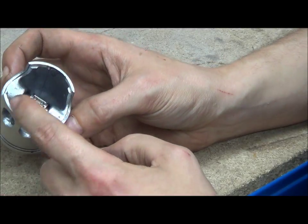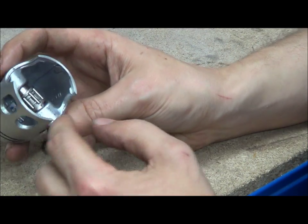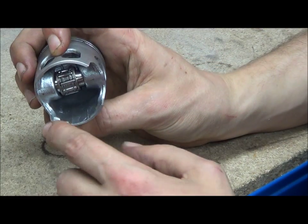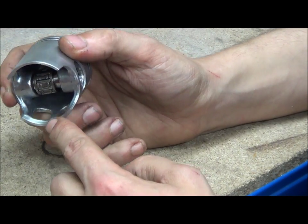There's still the gudgeon pin and roller bearing in this one. There has to be clearance inside and clearance at the sides of the skirts for the angle of the connecting rod — that's quite important when designing pistons. They usually machine a little rim out of the inside to ensure plenty of clearance.